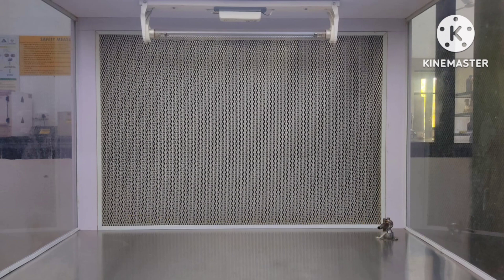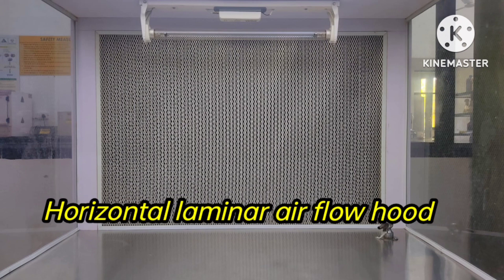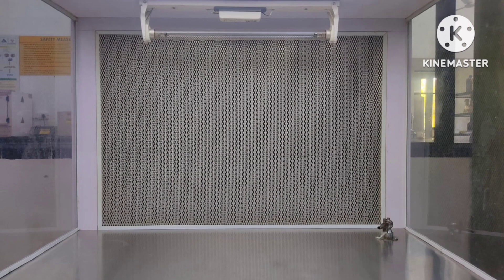If the device is horizontal airflow type, the HEPA filter will be at the back of the device; if it is vertical airflow, it will be at the top of the enclosure. As we can see it is at the back, meaning this is a horizontal airflow device. While the HEPA filter supplies quite filtered air, it isn't completely sterile — microbes less than 0.3 microns in size can pass through the filter, and some outside air does get in.